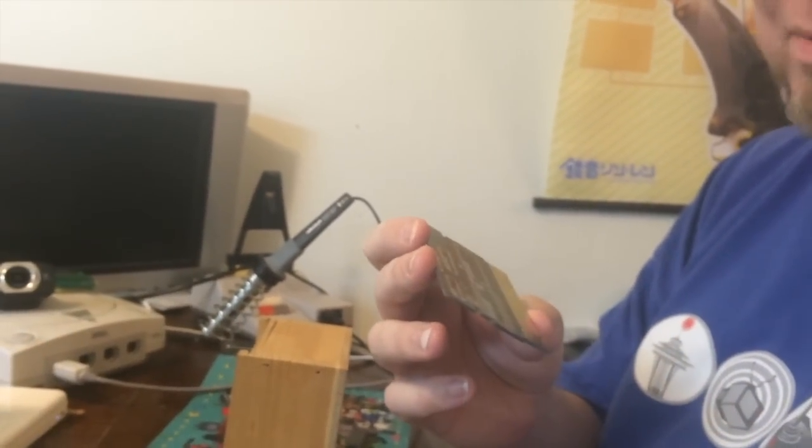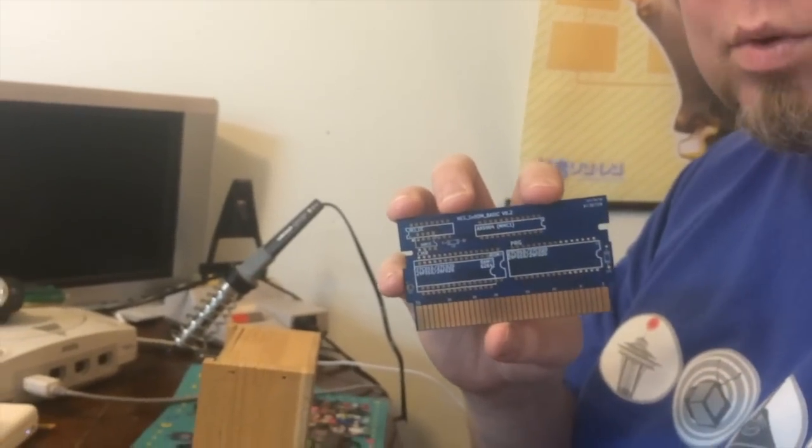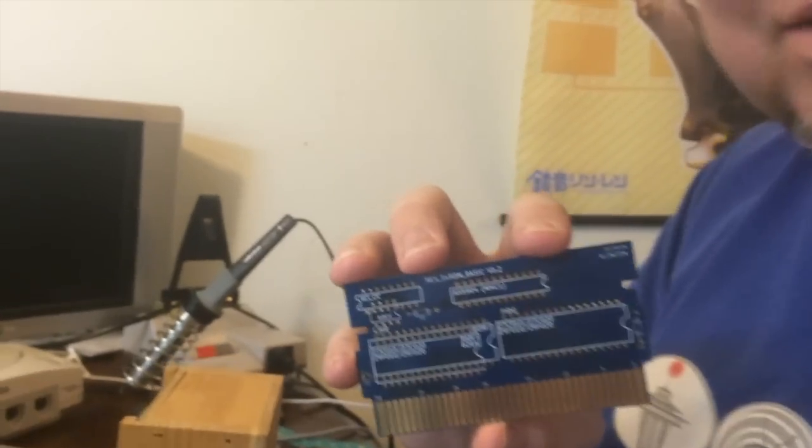We're going to try something that would involve wiring, but I'm going to see if I can do it without wiring, and that's going to make it so much easier on me. Here's an SxROM. SLROM will work if you're making a new Ghostbusters 2. SKROM, a lot of great games you can make with an SKROM, like Mike Tyson and whatnot.